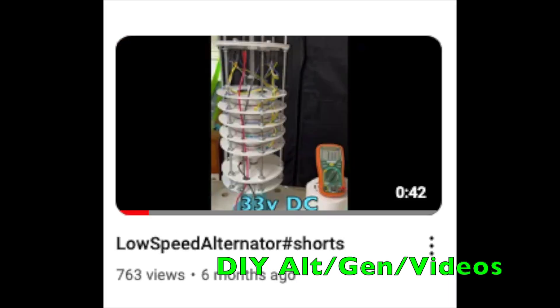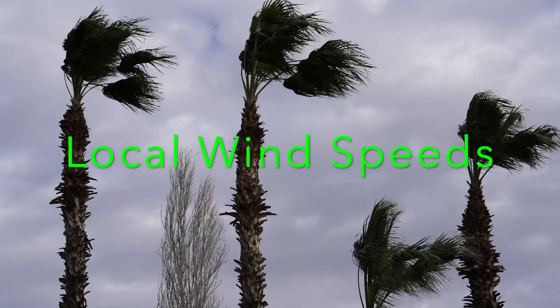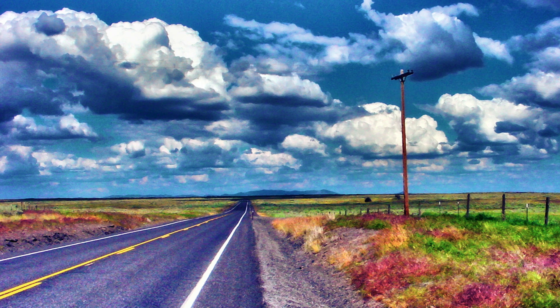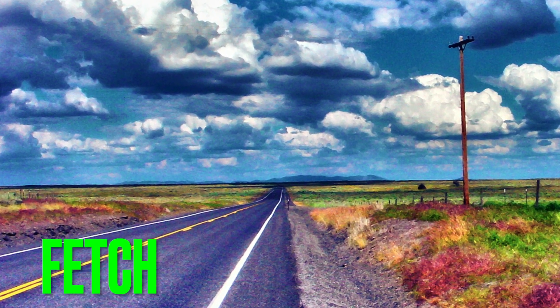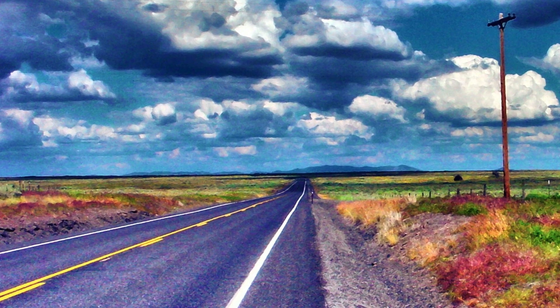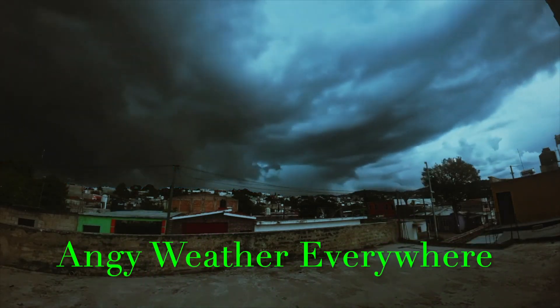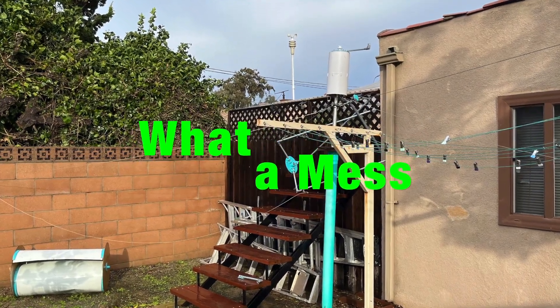I've got a few videos on building your own generator. Check average local wind speeds for your area to determine which VAWT is best for your needs. You must also understand Fetch — it is the distance wind travels over land or water uninterrupted. Good Fetch can produce dangerously high winds. Some are sustained, some are like rogue waves. Both destroy VAWTs.